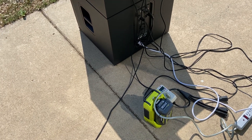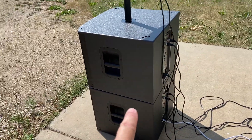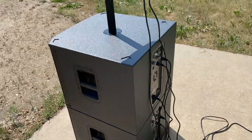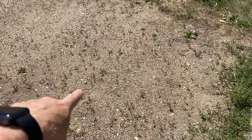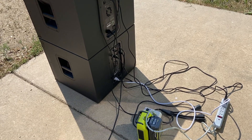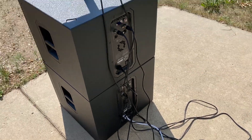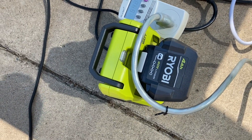So that gives you maybe an hour and 15 minutes at that volume and draw. Obviously if you're doing ceremony audio, you probably won't run two subs — you might be running two tops — and this unit handles that quite easily. This particular unit gives 300 watts of pure sine wave power and powered these three speakers for over an hour of runtime. At 35-40 feet away outside you'd be asking the DJ to turn it down, and at 120-130 feet it still sounded really good. You've got some great cabinets with real throw and you can do it with a Ryobi inverter. This is John Young — thanks for watching.